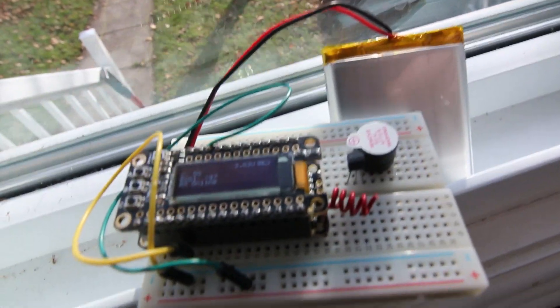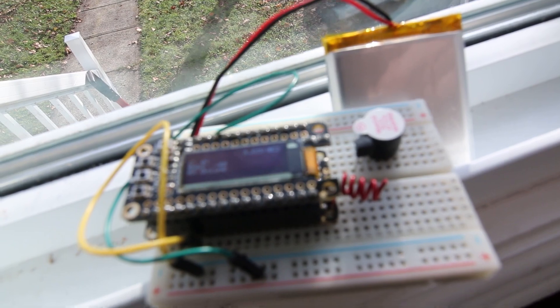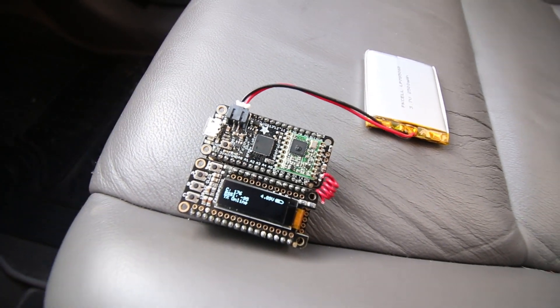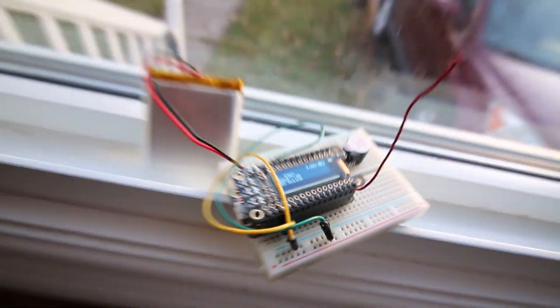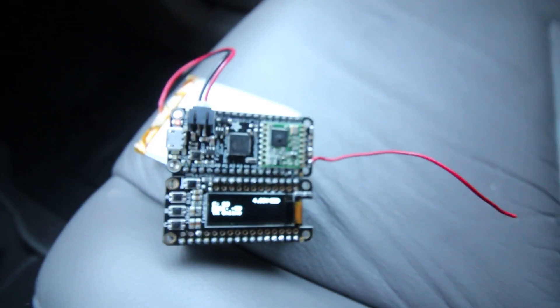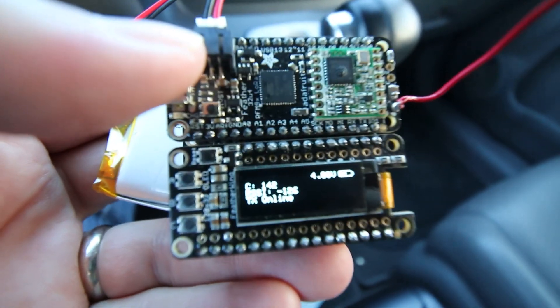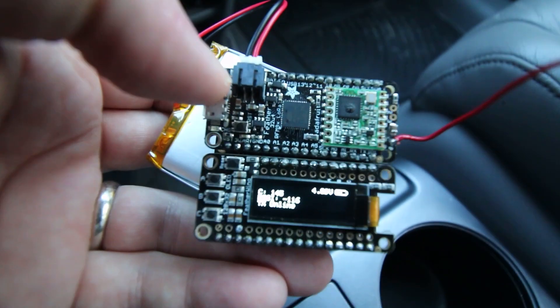For my slightly non-scientific testing, I went ahead and put one module in the front window of my house and set the other module on the passenger seat of my car. For the first test with the antennas coiled, this failed quite miserably and only made it to about the end of the block before RSSI was virtually nothing. For my next test, I put the module in the same place except with the antenna extended straight out on both of them. I went about one kilometer to the north of my house at ground level through multiple different buildings and trees, and that was where the signal petered out. To the east, I was able to go about 1.2 kilometers before I ran out of signal strength.